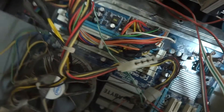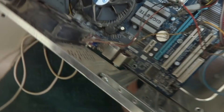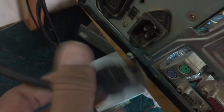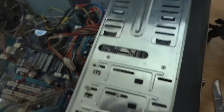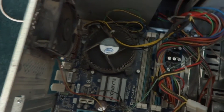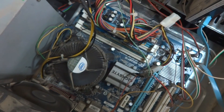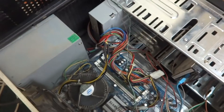Now I'm going to switch on the power supply. I connect the 24-pin connector down onto the motherboard — it's clipped. The VRM connector is also clipped in. I put in the power lead. The screws are not fixed yet but everything else is in. I switch it on from the power button and, as you can see, the CPU switches on — you can see the processor fan and the power supply fan both running. The system came on very well without any problem.